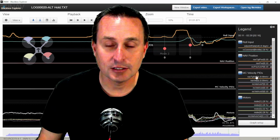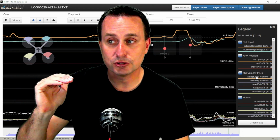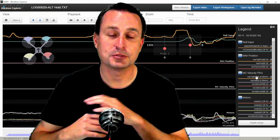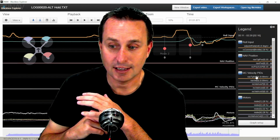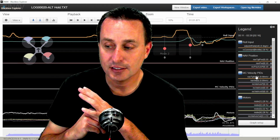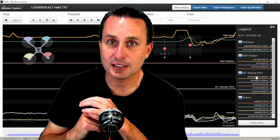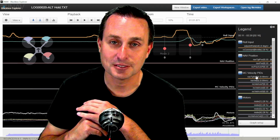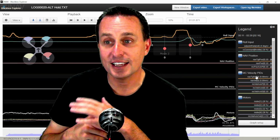But again, in multicopters, you're dealing with a position estimator, then a velocity estimator, and that is used not only in Altitude Hold, but also in Position Hold as well. So you have these two PID loops that you're dealing with. If you're having issues, I would say Blackbox Explorer is probably the easiest way to figure out which one it is. You can try trial and error by just bumping up the P term on the position estimator, but it might not be so straightforward, because it could be the velocity PIDs that are a problem, not just the position PIDs. But we will get into more detailed, step-by-step tuning of Altitude Hold in the next video.